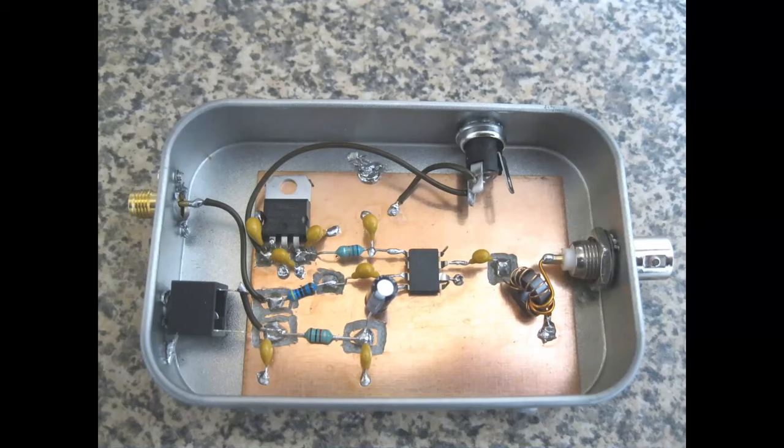So the same kind of pitch when you're putting things on. And they're not very expensive. And all you do is you mark out where you want, you Dremel them, and then you just tin those little pads, and you go over it with a multimeter and make sure that there are no stray little copper traces or anything. And yeah, works pretty well.